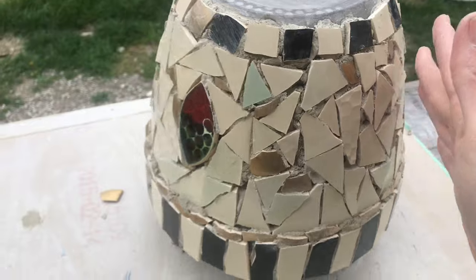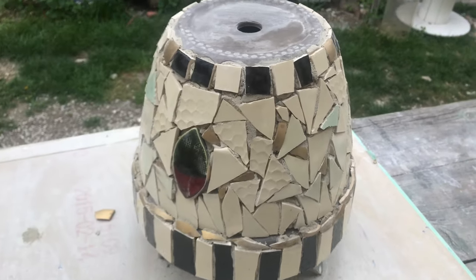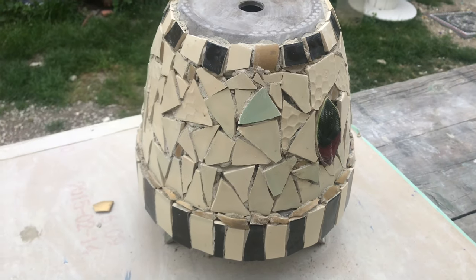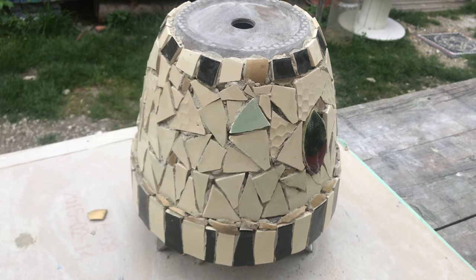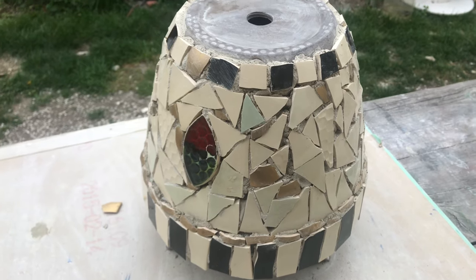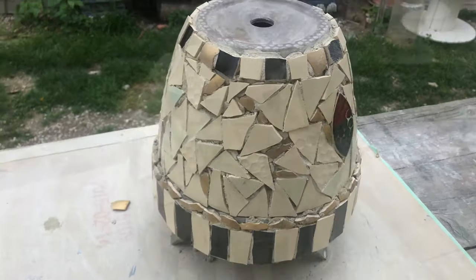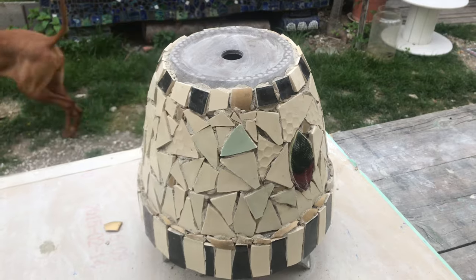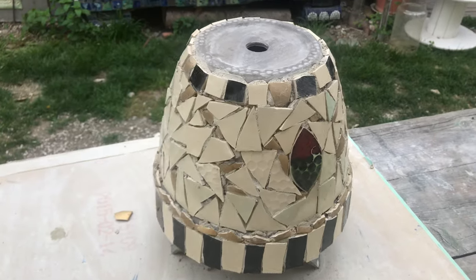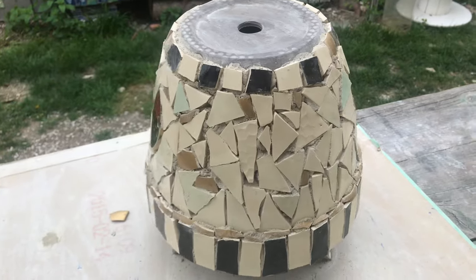So this is an open mosaic. It's open, meaning there's no grout on it. I'll get some grout tomorrow. We always use a dark grout on light or the white tiles. And on darker projects, we tend to use a kind of off-white or sand-colored grout. On this one, I probably will use my favorite grout. It's a charcoal grout. In German, we say anthrazit. It will look pretty good.